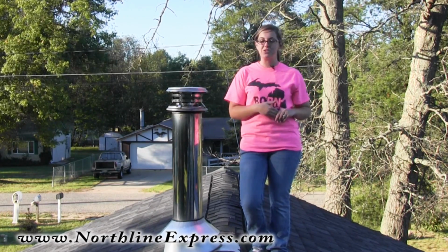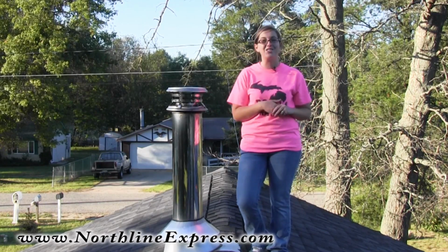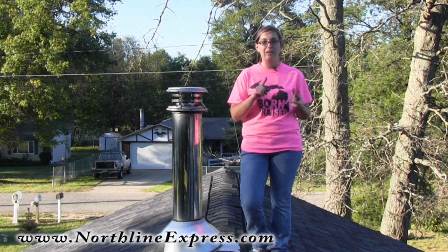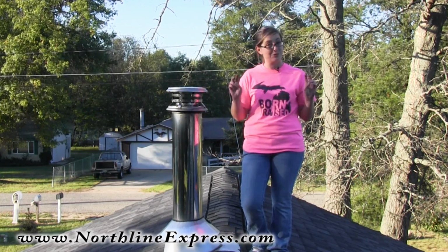If you follow these tips and tricks to get the right brush, the right rods, and clean your chimney without making a giant mess inside your home, it's a project that any homeowner that's a DIY lover can absolutely do. Make sure that you're cleaning enough, you're cleaning before you burn, and you're cleaning at the end of the season after you burn before you put it away, so to speak.